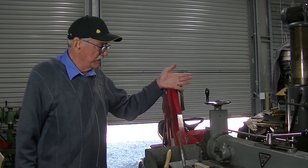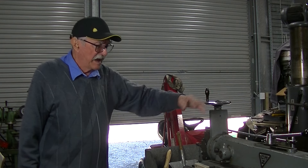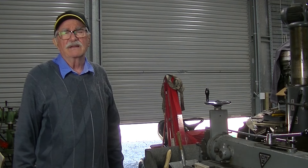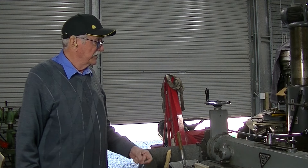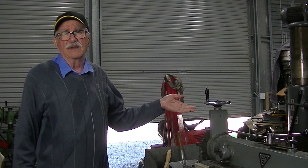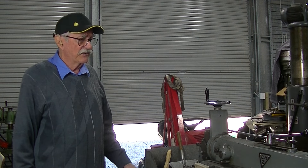So the machine runs okay. There's been no damage done in a minute of running. It's all just plain slides and great big gears and bearings that just won't be affected with no load on it. But I've got to go through the rigmarole of taking the side plate off again and either pull the pickup tube out or use something to wipe the snot off the end of it. So I thought I'd take you through that.